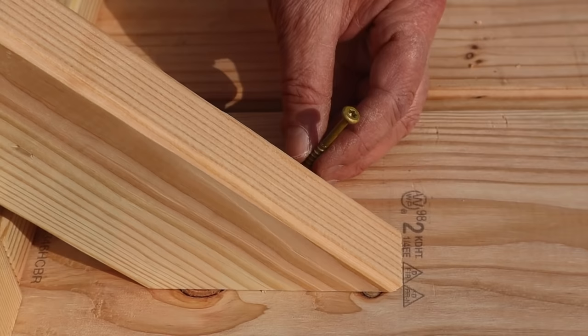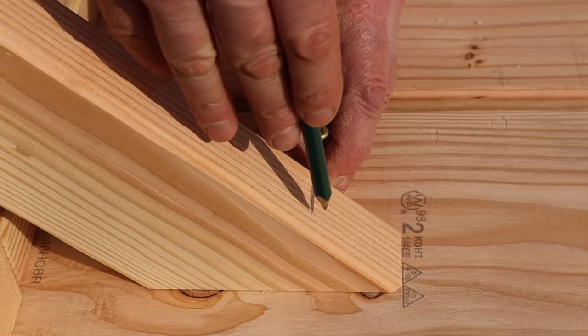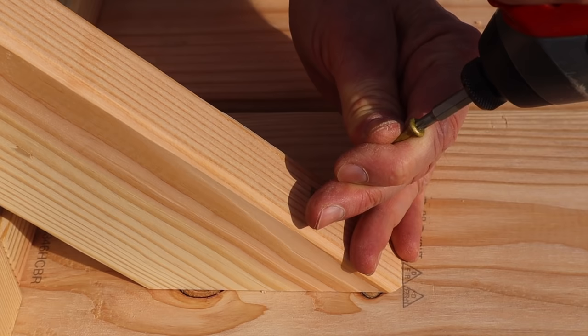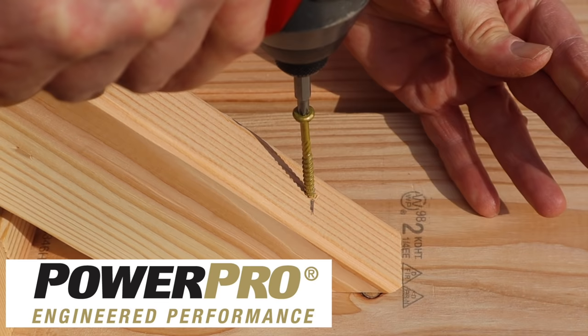Here's a quick tip for starting and driving a screw in a board that's on an angle like this. I want to drive the screw on a 90 degree angle — I don't want to go in like this. So first I want to get a sense of the height of where my screw should be, because I don't want to go through the seat. When I start the screw, I'm going to start in at a 90 degree angle to the board. Once I'm in a little bit, I'm going to bend up — I'm not bending the screw, I'm bending the wood fibers. Now I'm at 90 degrees, and I'm good to go.